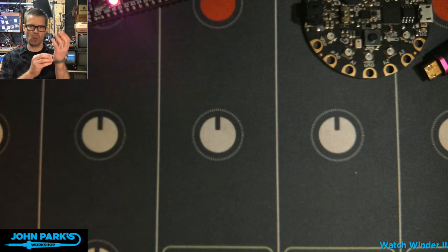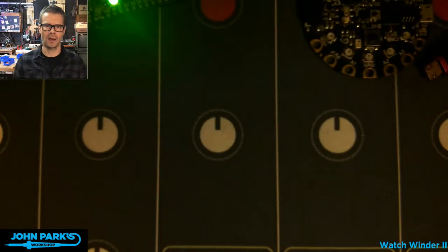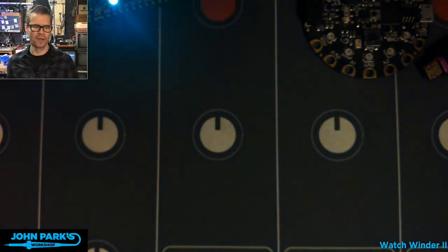And so this stays wound just by wearing it, and it's designed to be an appropriate amount of winding for when you're wearing it, so that it doesn't stay fully compressed all the time. The spring needs to unwind a bit, or it can degrade its effectiveness. So the idea with these automatic watch winders is on days when you're not wearing the watch, you might have 30 or 40 hours of reserve on a typical mainspring before it's gonna slow down or just stop.